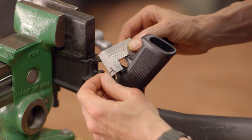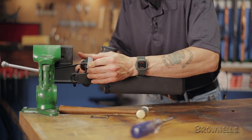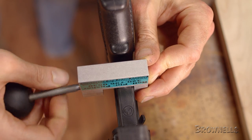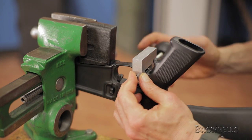We'll start by inserting the rear roll pin. Align the tool with the rear roll pin hole and insert the alignment pin opposite of the hand screw. Next, unscrew the knob and fully remove it from the tool and insert the roll pin into the end of the hand screw. Then reinstall the knob again and slowly tighten the tool while checking its alignment.